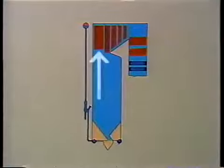A radiant superheater is built into the furnace wall just above the water wall. Since the radiant superheater is located in the same area as the water wall, you should inspect both at the same time. Radiant superheaters can have the same problem as any other boiler component. These include overheating, support failure, excessive ash accumulation, and failure of refractory around the superheater.